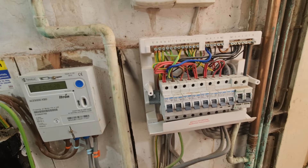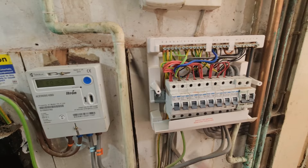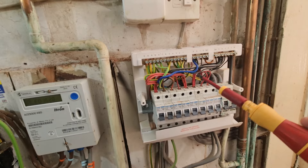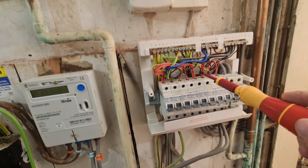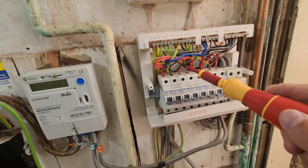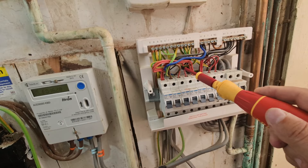We'll run through and make sure our protective bonding conductors are in place and that our earthing conductors are in place. Then we can do some R1/R2 testing on our final circuits - making sure that end-of-line and all the way through those circuits we have a measurement between the line and CPC on the lights, that we have full continuity around the ring for all conductors: line, neutral and earth. Then we do our figure-of-eight testing on these circuits, and equally see where this cable goes - the unmarked one, which I think is just the light in this cupboard, to be honest. Then we can form an opinion.